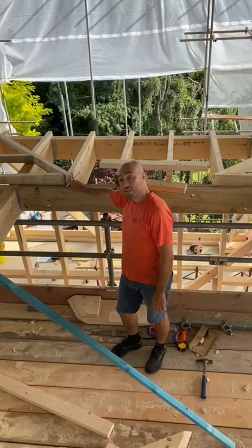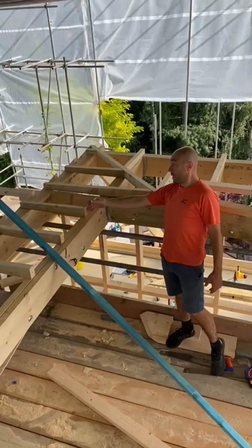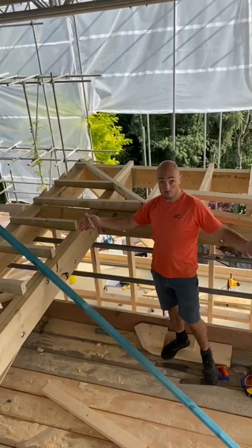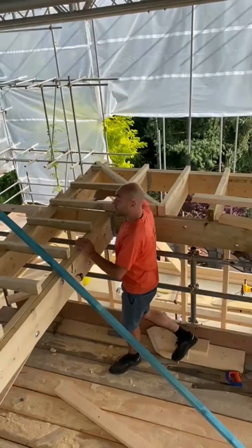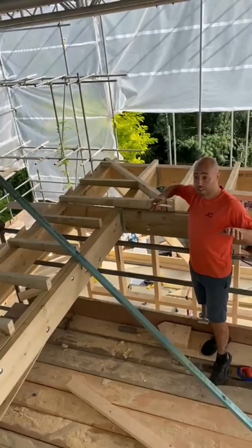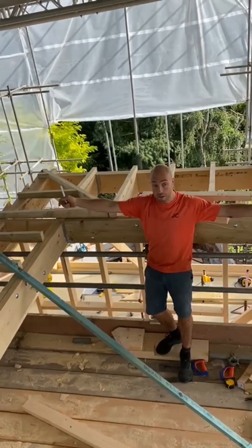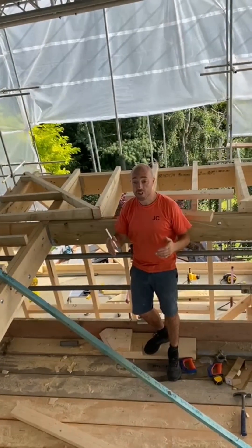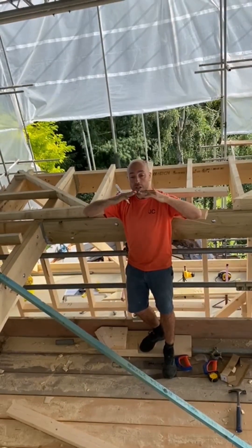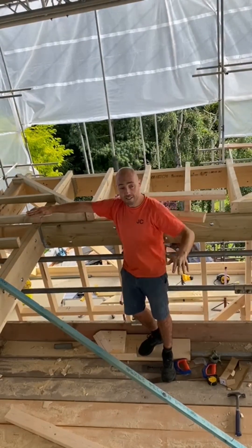Good work tips when you're doing your fascia pieces. We like to leave our rafters set up — if you cut our fascia pieces to a good size, that gives air flow, and then we can have a cold deck roof rather than a warm roof. When we set our rafters round, we use a block to do the same all the way round. We like to cut our fascia pieces all the way through — especially on a big roof — because it spreads all the water evenly to all the gutters. But even more so, it's how that finishes for the roof tiler: they all finish at the same round point. I see a lot of people doing them in one or two directions, but you've got to think about how they dress that with the tiles — this way it's the same and it's a good finish.